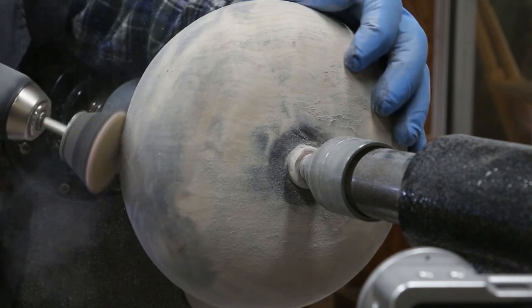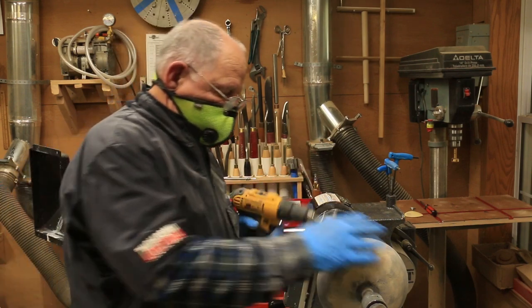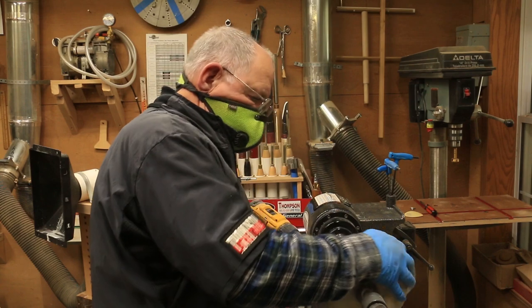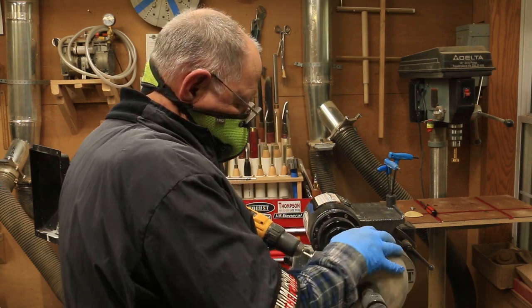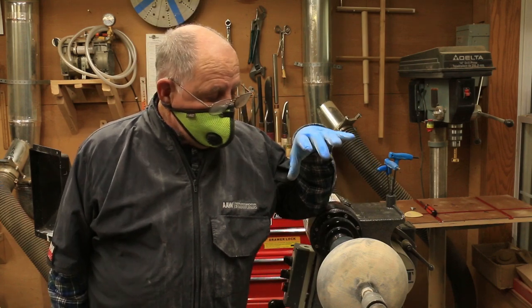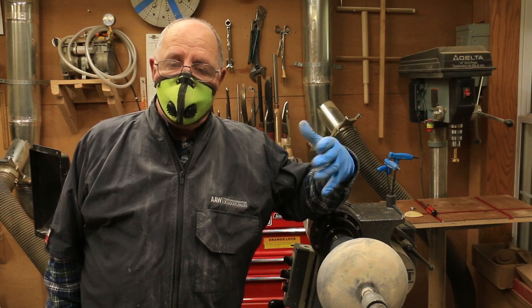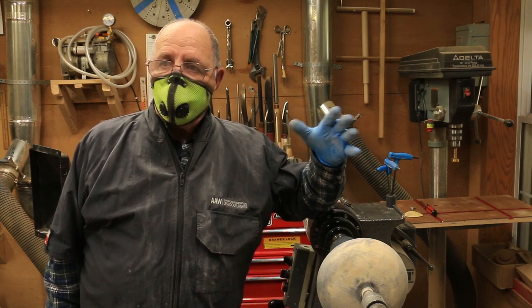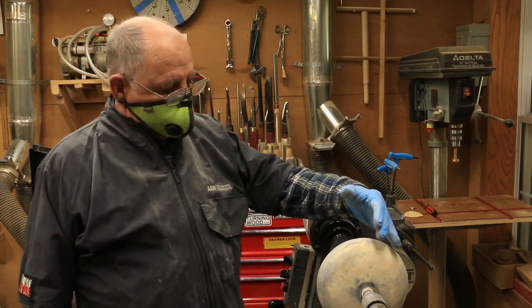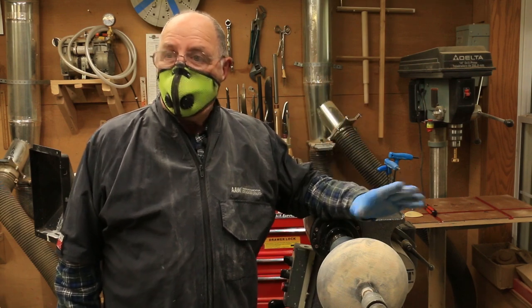For the newer turners, they're probably thinking this takes a long time. And yes, sometimes it does take longer to sand and finish a piece — a lot longer on a good piece — than it does just to turn the wood. One of the things about dyeing them is that any imperfection in your surface — a scratch, a tool mark — pops and really shows up. That's one of the advantages of first dyeing it black, because you get to see those and correct them.